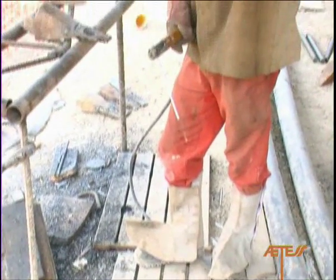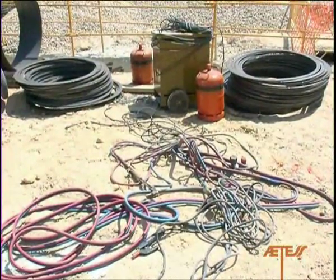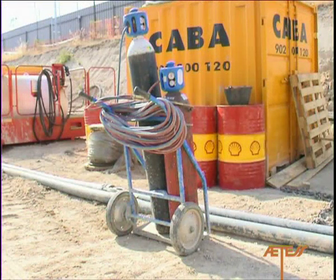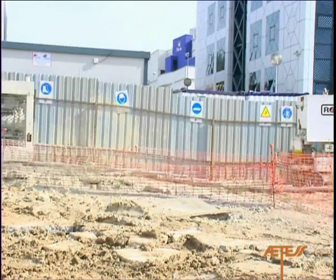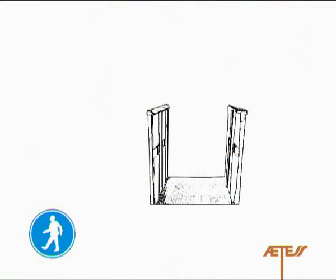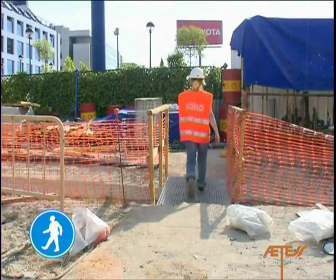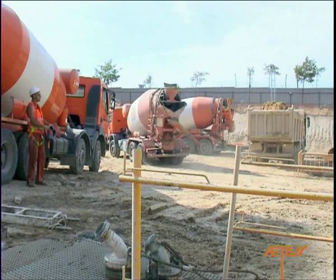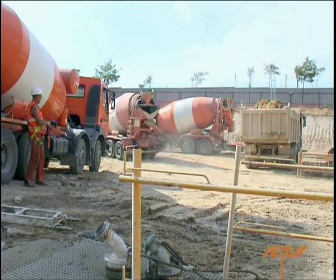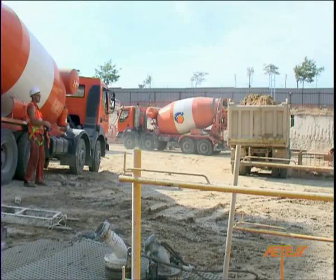The corresponding personal protective equipment, or PPE, must be worn in the workshops, and worker materials must always be kept in an orderly fashion. Worker access paths from the site huts to the work platform must be at least 60 cm wide and free of obstacles, comprising temporary stairs or ramps where necessary. The access routes for the machinery and supply trucks must be clearly separated from the paths used by the construction team.